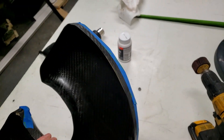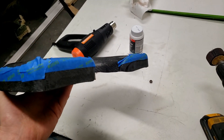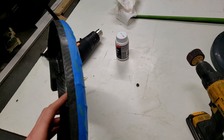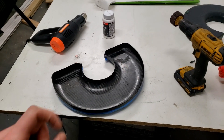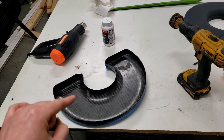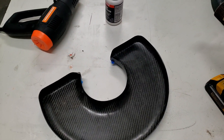I went to the CAD model and got my trim lines pulled out, basically from the top surface to here. I'm going to get suited up, put on my Tyvek suit and respirator, cut that out, and then I think we're going to be close to being ready to miter the tube. Then we'll see what we need to cut notch-wise for the miter.